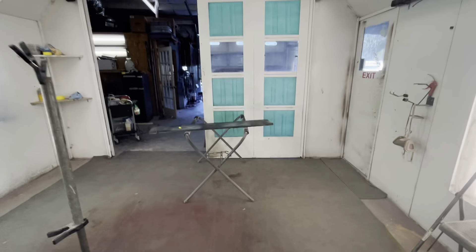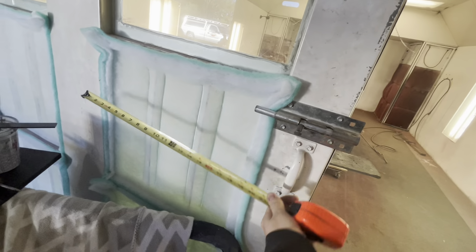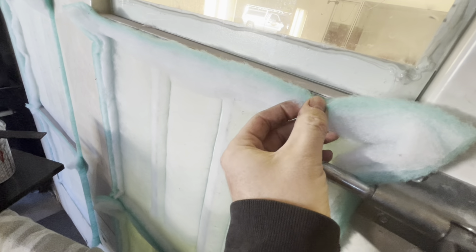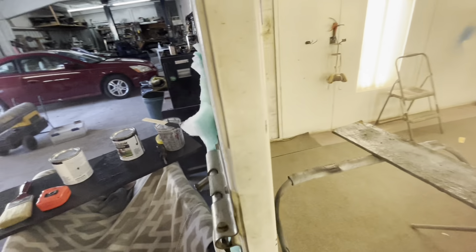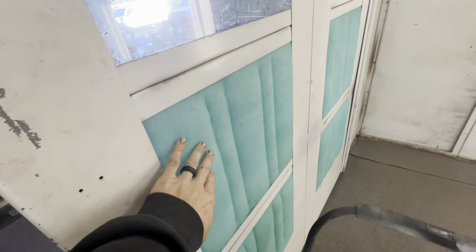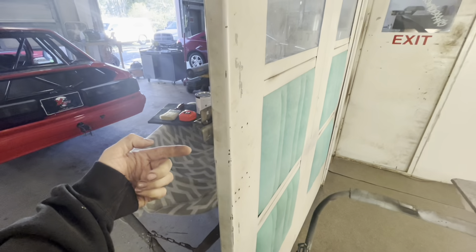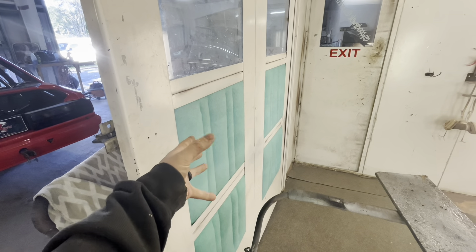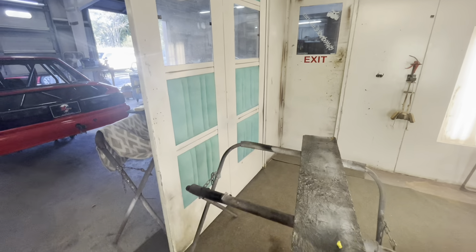The intake filters — your intake filters are also going to be 20 by 20s, but these are intake filters so this side's white. This is not fiberglass; it feels more like a coarse foam of some type, like an acoustic foam almost. And then the green side is actually sticky when they're brand new, so you'll feel it on your fingers. That's what makes trash come in, and then any tiny particles that make it through will get stuck in the sticky residue on the filters. As these wear out and lose their stickiness, you start to get more particles in there.